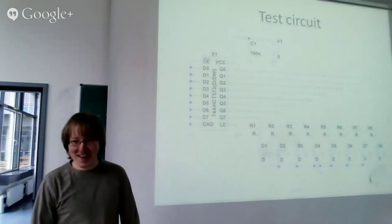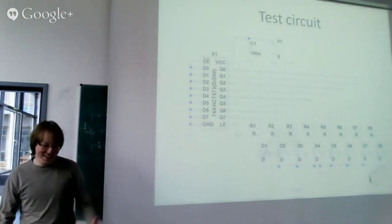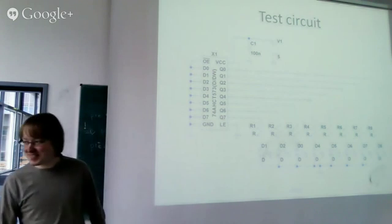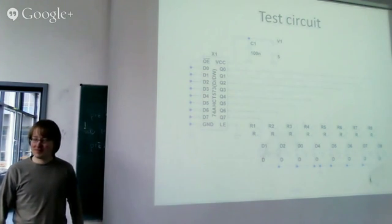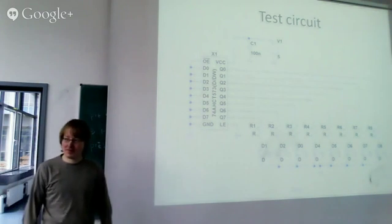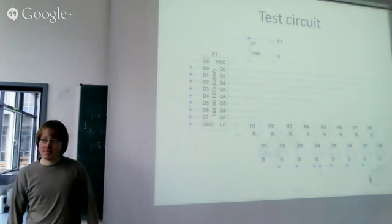So my hope is that any of you has had an idea, or maybe seen this problem before. Well, at least from physics, if you get a short pulse of something and you don't have any inductivity... whenever you want to work around short pulses and things like it, you put an inductivity in your power line. So having inductivity on both plus and minus to your circuit might help. That's what you always do.